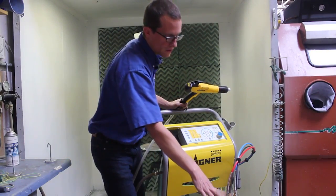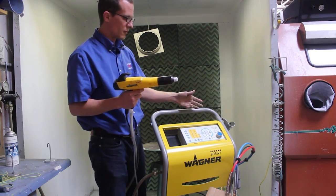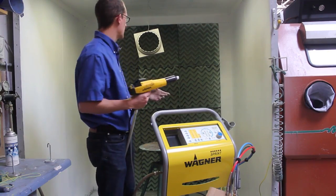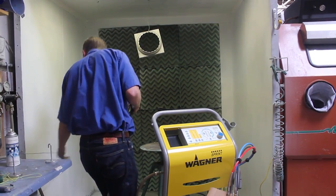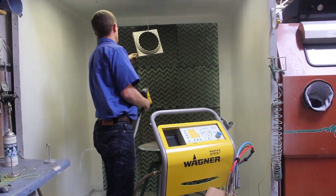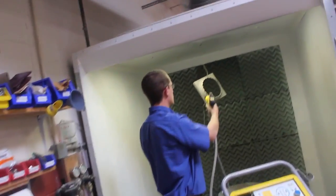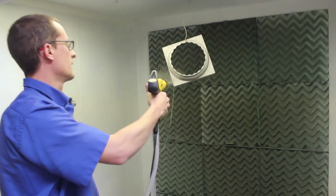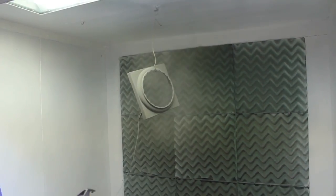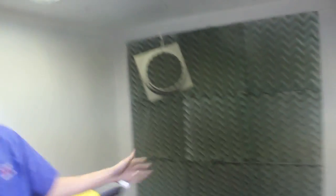Once you're plugged in and have your powder tube set in the media, go ahead and turn the unit on. You'd start on preset one, which is the most common and what you'd use in 90% of your powder coating applications. Your product needs to be grounded using a true earth ground. Hold the gun approximately 6 to 12 inches from the target and spray until you're confident you've covered the product appropriately. Flip it and do the other side to ensure even coverage.